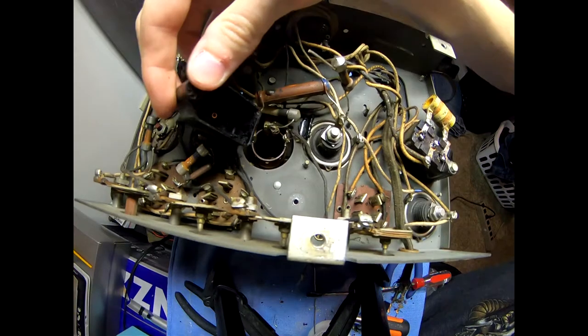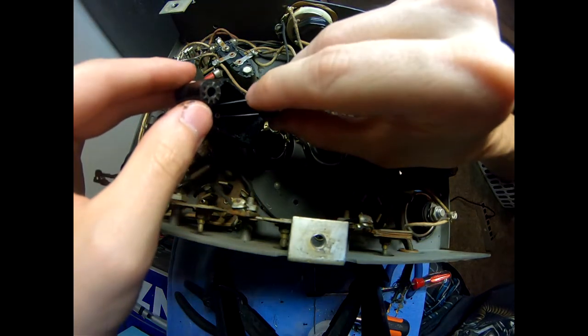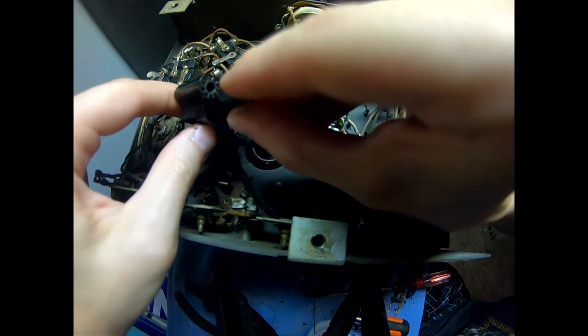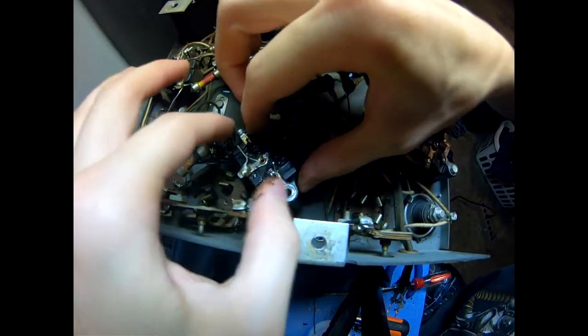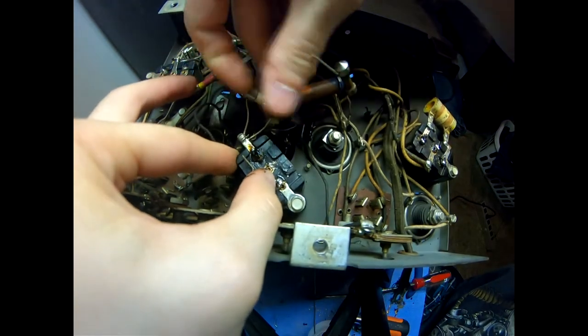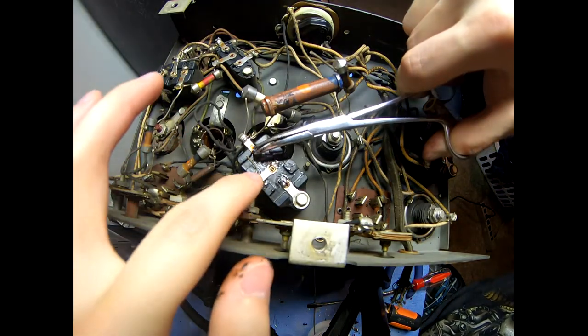Cleared out, plenty of space. A little bit of goo left in there but it doesn't really matter. Now we're just going to stick our first capacitor in there like that, and our second capacitor in there — one lead to the ground post up at the top, and the other lead to the other end. Slider all the way in, then flip it back over. The little star washer had pretty well glued to that from the tar. We can re-bend some of these parts so they go back in place, give it a twist or two so it sits still.